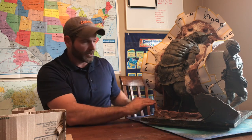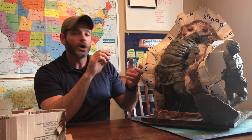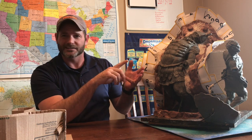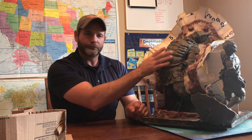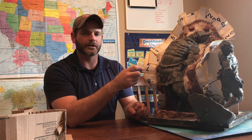So you create a wall here to protect that and keep it. Now on some sculptures, if you have a hard sculpture — an already baked sculpture in the oven like Super Sculpey or something like that — you can actually lay it on the ground and build a wall around it and it's much easier to deal with. But when you have a figure that's wax-based or modeling clay, sometimes you risk damaging it if you try to lay it down. So what we're going to do is a brush-on mold and I'll show you how to do that in the next video.